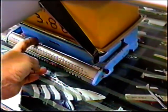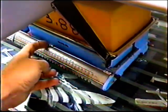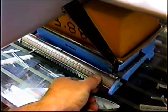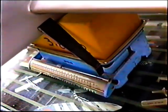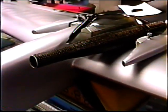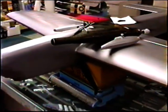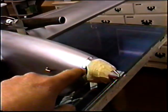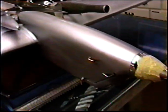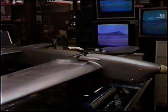Okay, so now you know what you know so far. You're at 3 pounds, and it's less than 10. Let's do it real accurate. You're at 3 pounds 10. It's 58 ounces? 58, and you need 4 for paint. Realistically, it's going to be 4, 5 if you don't buff it out. You're going to be 62 ounces. Okay, so I'm good. You're going to be 62, 63 with the real paint, the carbon gear. That's well within. And you can also put a carbon backplate. That's 1/2 ounce if it needs it. It's going to be under 63 ounces no matter how you cut it. And that's excellent. For that size wing, you're lighter than my Strega.